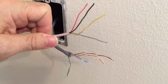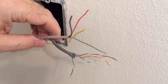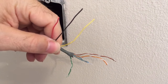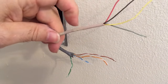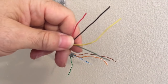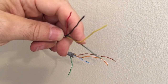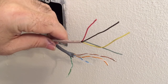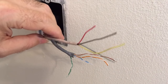The other kind you'll run into, more common in private residential homes — especially those built in the 60s, 70s, 80s, and even the 90s — is the four-wire drop wire, or two-pair drop wire. It's typically a tan jacket with four wires inside colored red, green, black, and yellow. You may even see some with a few other colors like blue and white. The key to residential wiring for a single-line telephone is just to keep the colors matched up.